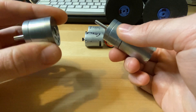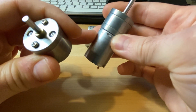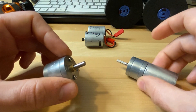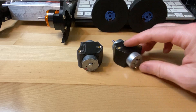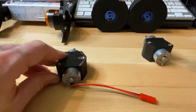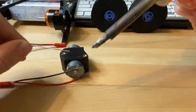These had huge globs of grease in there, which is nice. I tested the motors with my fingers and they seem to be identical to each other — very smooth, a little less cogging than the other ones. We'll have to test them and check out the torque. I swapped those original gearboxes onto the new motors with a little bit of grease added, and then we'll see how these do. I just have to solder some of those wires and deal with a few other factors.